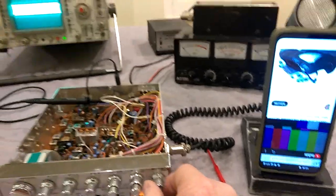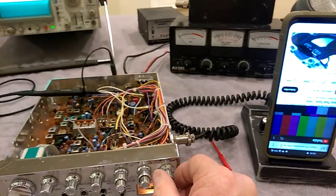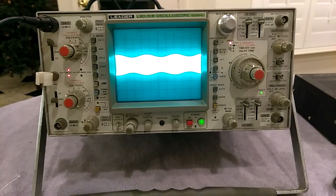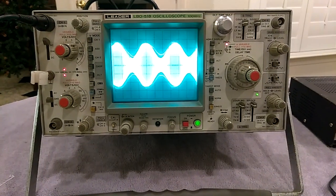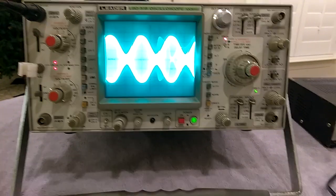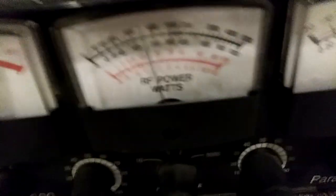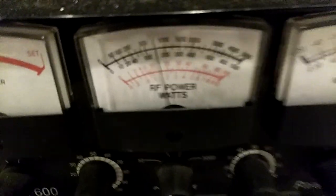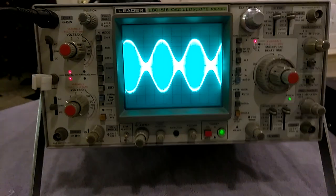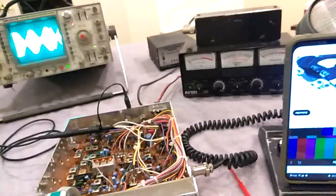I haven't done any fine tuning on it or adjusting — just set the carrier at one and a half watts. And that's what I get: almost two hundred percent modulation. And that's where we are over here — one and a half watts swinging to 15 watts, and the modulation is right on the edge there. Happy New Year.